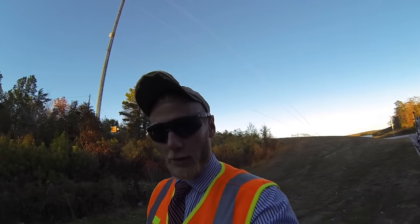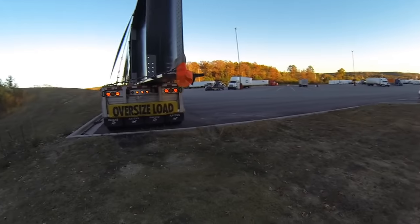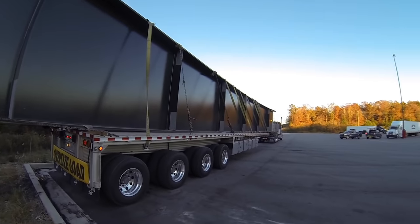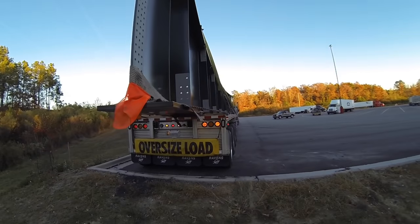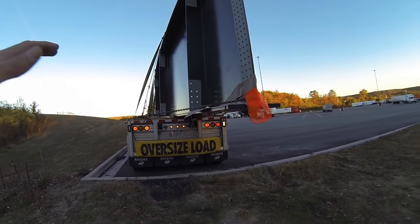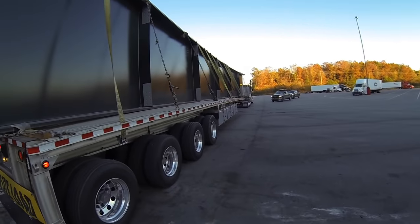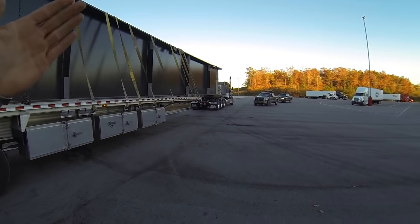The final thing that kind of threw a wrench into the plan — which we didn't know initially but found out real quickly — is that this is a curved beam. One of the intricacies that added to it is if you load this thing directly center down the dorsal line of the trailer, it actually puts a majority of the weight on one side. When we initially did that, the trailer had a hardcore cant to it. So we had to adjust it, keep moving it over until we finally got it where it needed to be, and then do the exact same thing on the bunk plate — get it right on the dorsal line so that it would track straight.